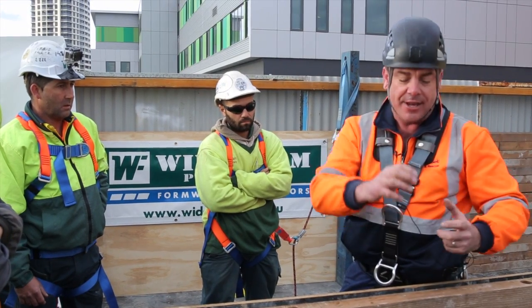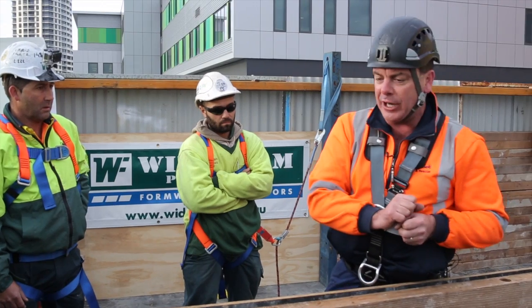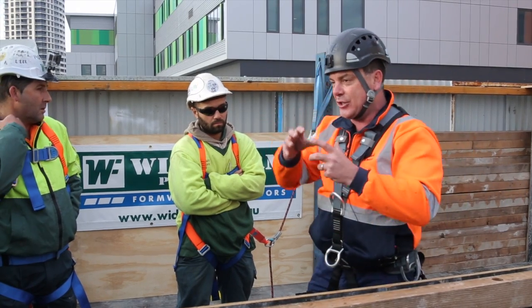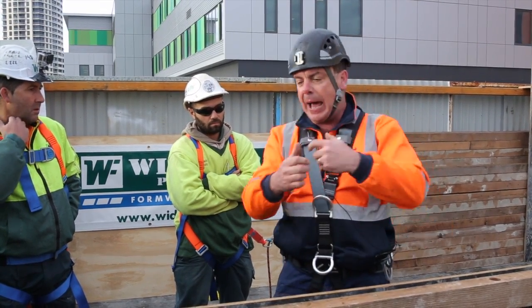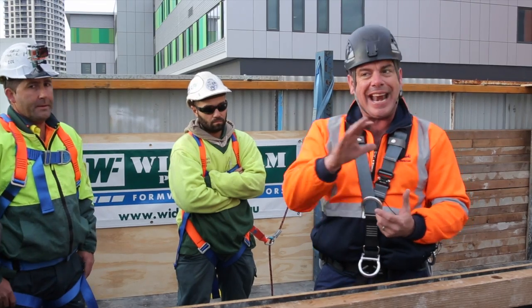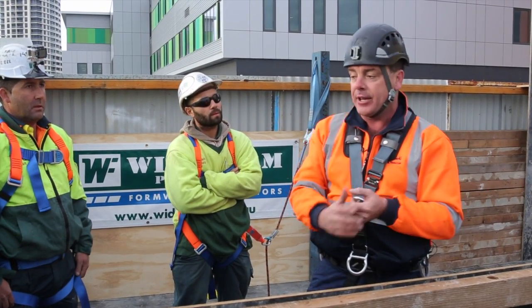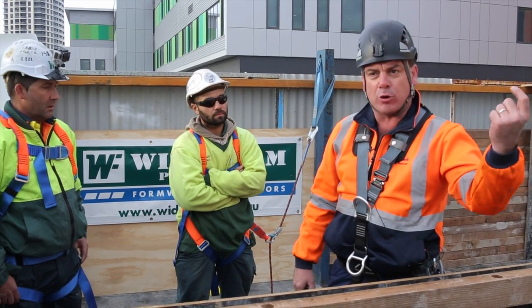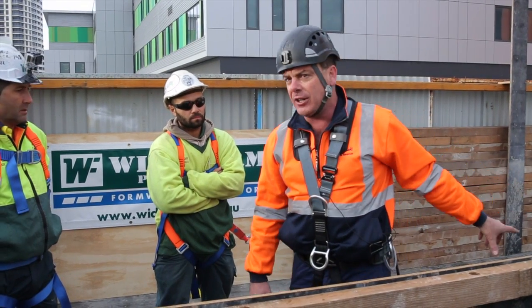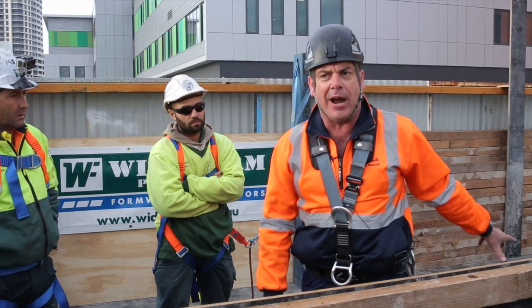You pull slack so that eventually the casualty in the stretcher ends up suspended on the tripod. What you don't want is slack in the system. It's when you lift it up, there's a bit of slack and they drop the casualty, yeah? So you want to make sure you're reducing any possible shock loading. Saying that, that anchor point on that tripod's rated to 15 kilonewtons, 1.5 tonne. The rope in that device has a 2,300 kilo breaking strain.